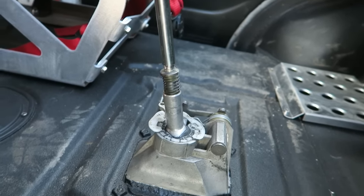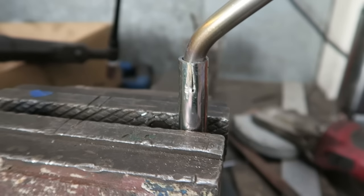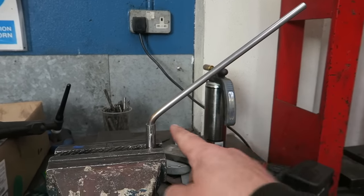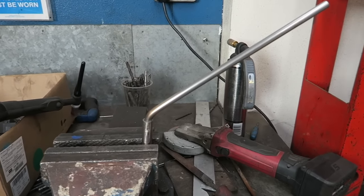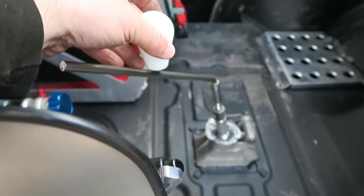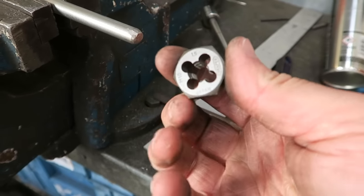Chop to here with the bar on the top. So now I'm just going to put the first bend in, get this nice and hot. Cut a slot to bring the top down to about 10 — obviously that'll be welded in situ. So you can see now we're getting that nice 45, about 4 or 5 inches across. I'm going to thread this first to make life easier, and once I've done that I should be able to cut it down, get the final bend put in and get Si to weld it for me. I'm just putting a thread on the end — got this off eBay for two quid. I don't know how well it's going to work yet but we'll give it a go.